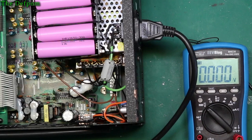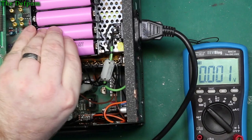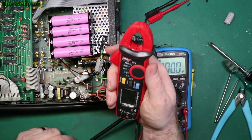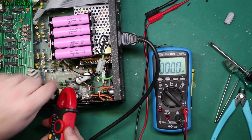Well, that's a bit inconvenient. Is the battery back in? Pulsing again. It's a little bit concerning actually. It's not meant to be doing that. It's a bit too much current for it, so I'm going to pop it out, it's okay. Let me get my current meter out and see what it's doing. Well, I've got this little ammeter here, so you want 2 amp scale, that should be enough. You want DC, zero it, and let's see what current we've got going through here.